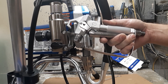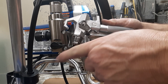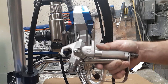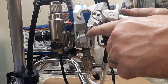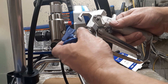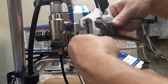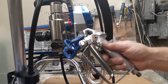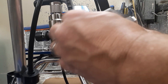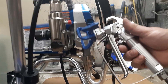Give it about a minute to a minute and a half — fresh water is best because it leaves no residue, but recycled water works if you run it that long. Once you're done, don't let go of the trigger — reach over and turn the machine off. Once off, the pressure will die down to nothing; then let go of the trigger. Put your housing back on with fingers behind the trigger, get it firm. To clean the inside of the gun, there'll be some residual pressure — just pull the trigger and it'll spit a little and you're done. Wash the outside of the housing to prevent buildup that could affect spray performance.